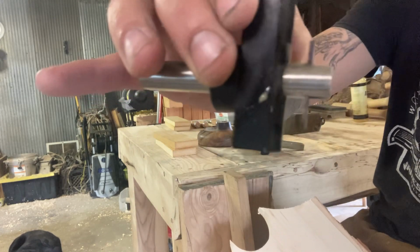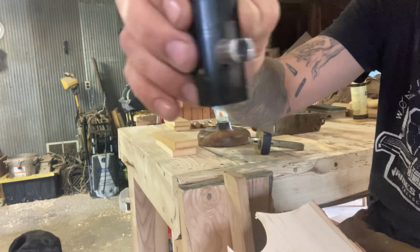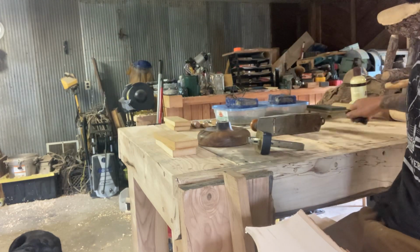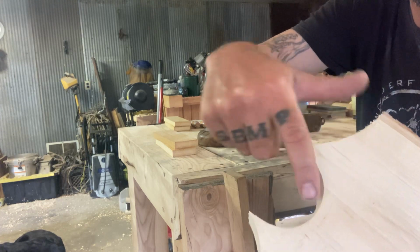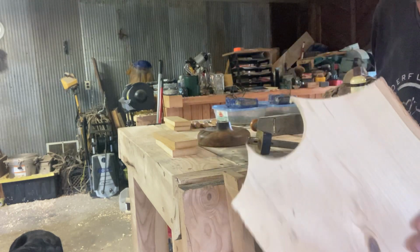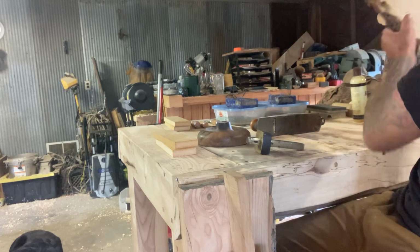And with this one, it's flat on the back side here, so you can use it as a chisel gauge, part-time chisel, and then go in with your chisel and just clean off on the inside here, and then you're not cutting on the outside for your instruments if you're going to use it for doing purfling. It's pretty much what it's designed for.